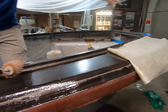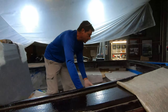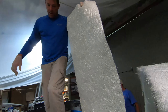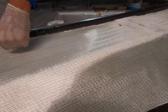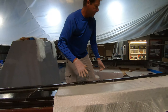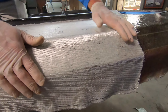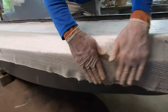We flip it half over itself — one half is slipped over the other. We've already rolled resin underneath one side, kind of stuck it, and that's what I'm doing here while Mark works behind me with the little hard roller. We've already got the bow section done. Now that we've got resin underneath this we're just placing it right up to the corner, working out the wrinkles as we go. I do like to wear gloves because it lets you work with this stuff without getting loaded up. Mark did a good job — he's the glass man on cutting and fitting.